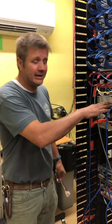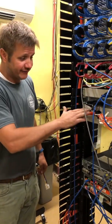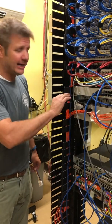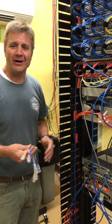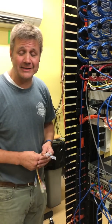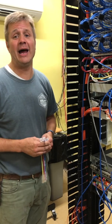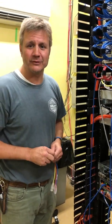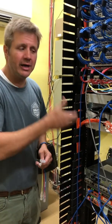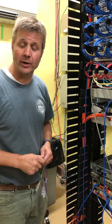What we're trying to do is make sure it's all nicely and neatly set up, but we're also planning for the future. We may even, if the customer allows us, drop these Meraki switches and the fiber switches down some and reserve one more patch panel location. Because I hear it said all the time — 'oh, we're never going to get any more cables, this is all we're ever going to have' — but think about it: you're going to get more cables, so you might as well go ahead and plan for the future if you want to keep your rack and cables neatly organized.